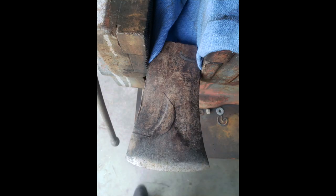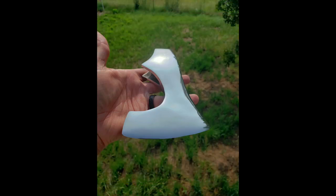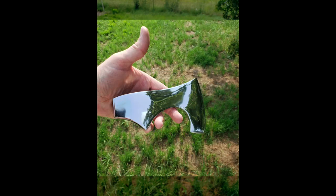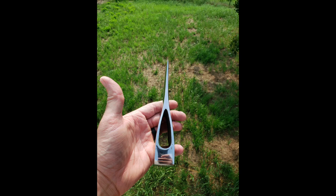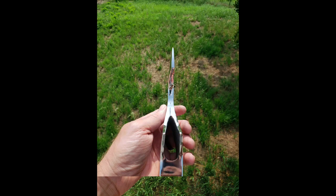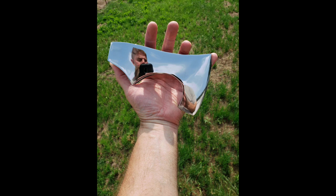I think this was a 50 year old axe head that I decided to make into a Viking long beard axe, just to see if I could. It worked well — I polished it from 125 all the way up to 4,000, painted it with alkyd paint, then used transfer paper to get the design I wanted on there, then used a little scratcher to expose the metal underneath.